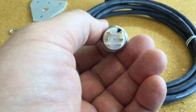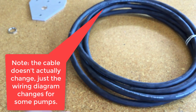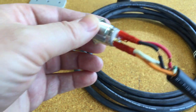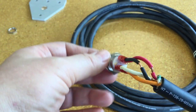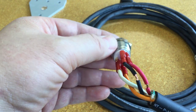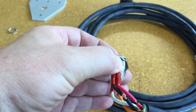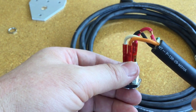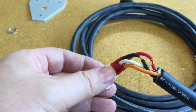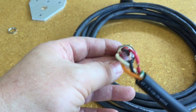The plus and minus change a bit depending on which CPC5 cable you're using. Let's first look at the original CPC5 cable used on the G3 Max, G3 Pro, and G1 Plus. You can see black and red right next to each other — black is on number three, orange is down on number four, and white is on the left side on the plus sign. That's how you wire this push button for the G3/G1 CPC5 cable.